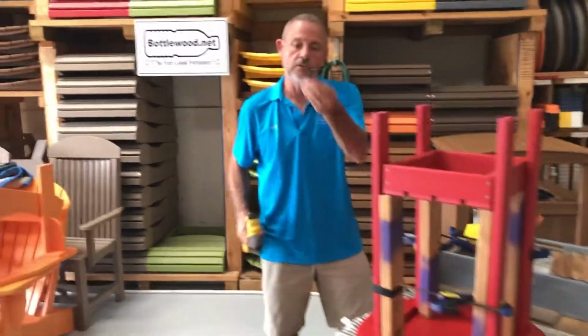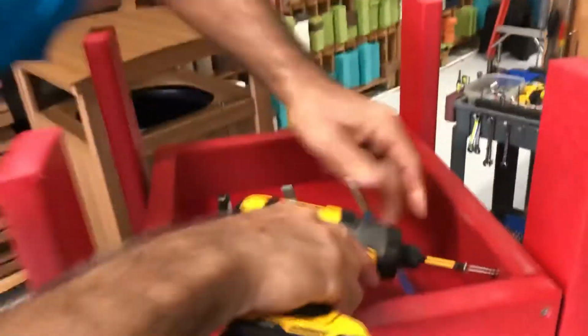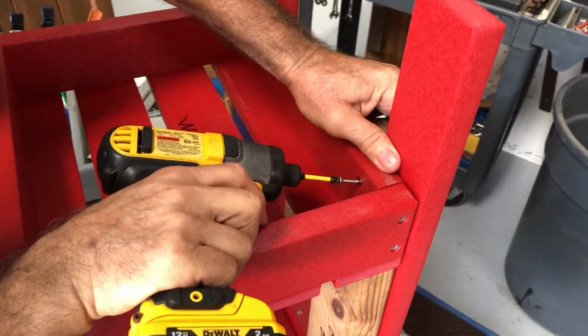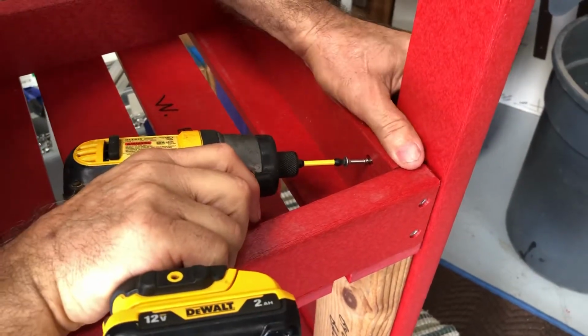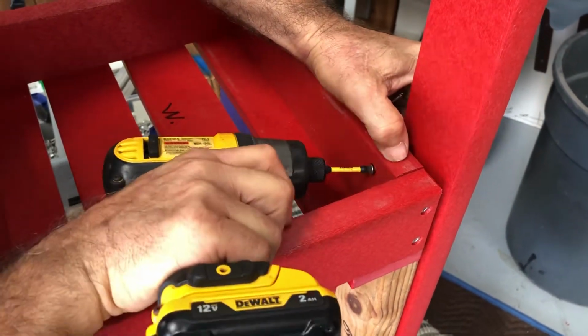You're going to grab your screws. Now this is the important part. You want 1 screw, get it started, and then on your leg right here, this is just for aesthetics. You want this sticking out, about 1/8 of an inch is good. Pull it nice and tight and push down on the board. If you need help, get someone to help you.